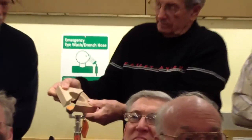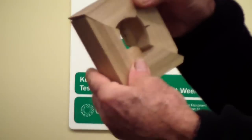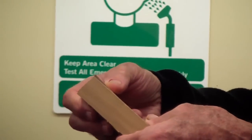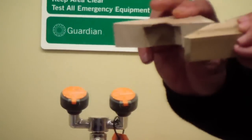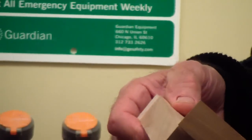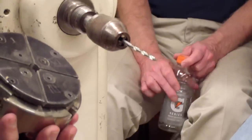Those squares, sometimes, no matter what jaws you've got, they're not right. And those will screw onto some other jaws on your chuck. And then you simply hollow out to hold that finished piece of furniture so that you can make the repair part on it without screwing it up. The jaws here are really, really nice.